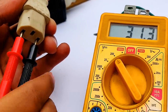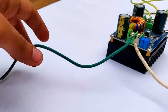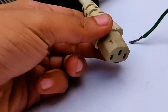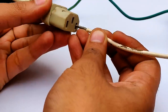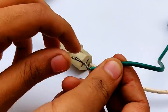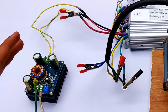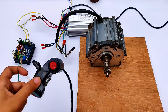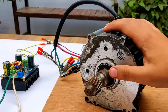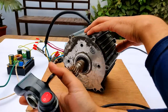Connecting black and red probes: the output is 30.8 volts, so the left terminal is positive — left for L, red for R. The green terminal is positive and the white one is negative. The negative has been connected to the right terminal and positive to the left. Connection has been established and now all that is left is to run the accelerator to see the motor move. The accelerator is on and it's ready — hold it steady because it's going to jerk before starting.